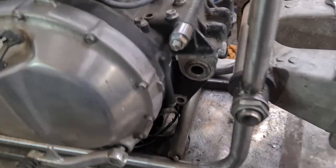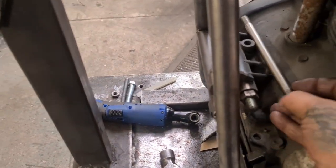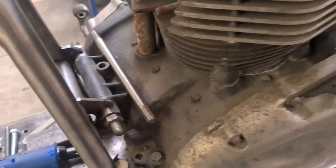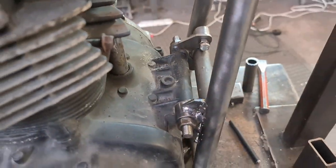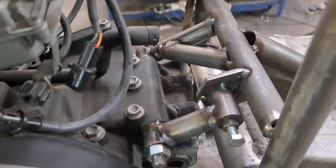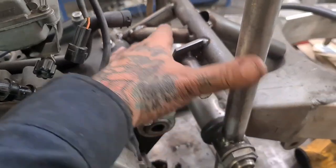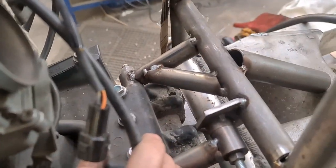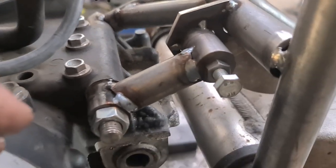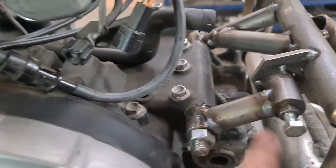And here's the front one. The back one's there in place, ready to sort the back of the frame out. Here's the front one ready to replace that bit of studding that I put in there. So there you go, you get the picture. We've been busy. We've put that proper bolt in there, the stud, if you like, and we've made a rear mount. We've done this rear mount in an Isambard Kingdom Brunel type action method with a removable section. This is welded onto the bike, and that unbolts for the other side, much the same as this.